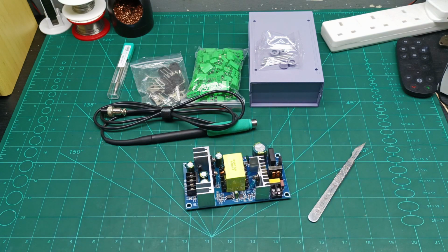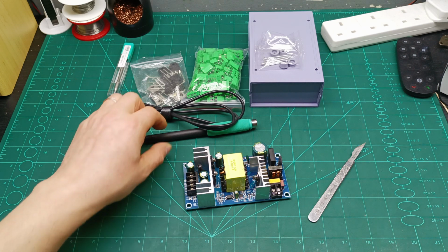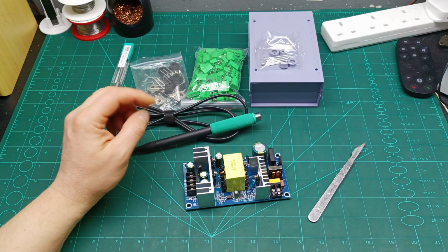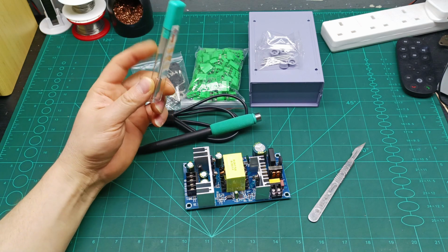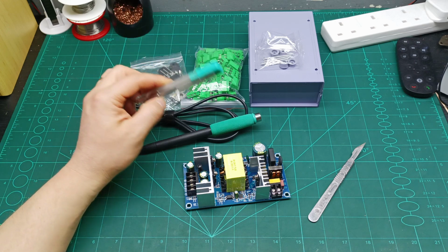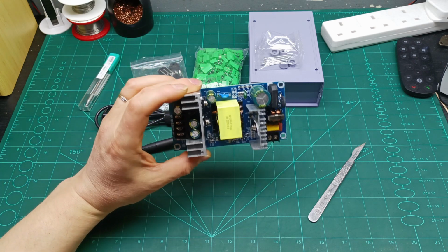So why 9 amps if I have this one of 4 amps? Because T245 requires 8 amps to power the iron tip. T12 requires just 3 amps. And that's why I got this one.